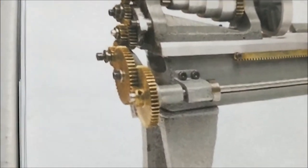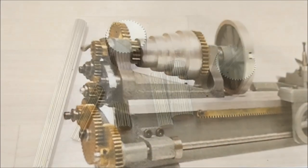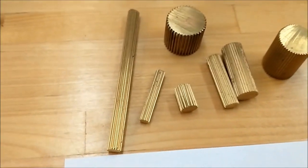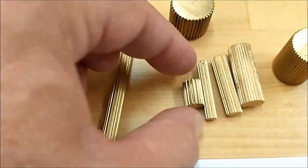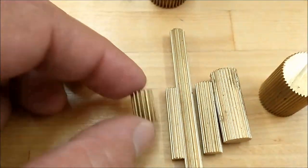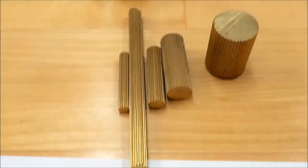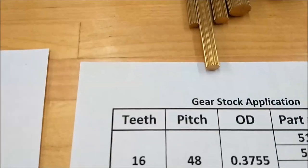So let's take a look at the stock, the charts, and the dimensions on these guys right here. The material provided is already splined and it is not marked, so it's going to be up to you to figure out what goes where, and that's relatively easy just going by size. Try to figure out what has how many teeth, put those together, and for all the other, finer gears, I'll just go by the diameter, and the diameter will be the dead clue for how many teeth there are